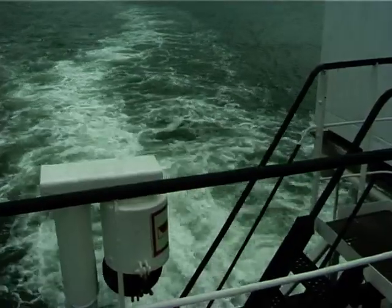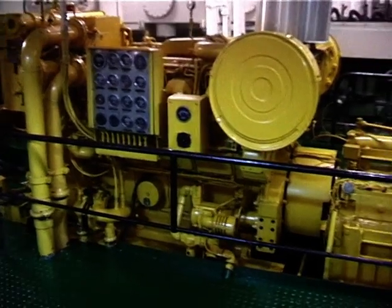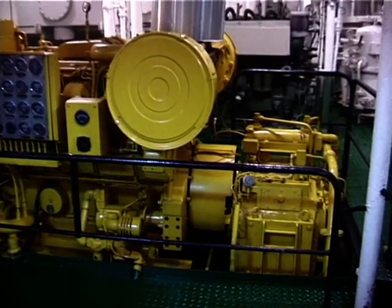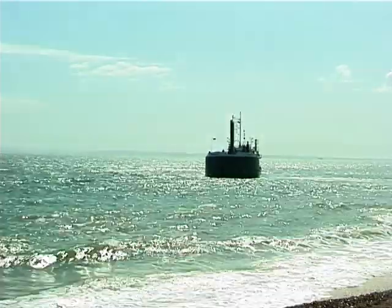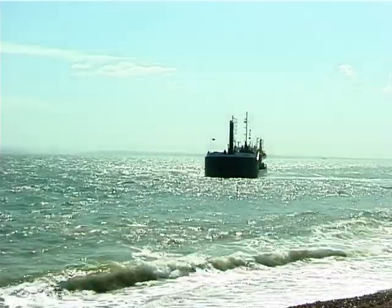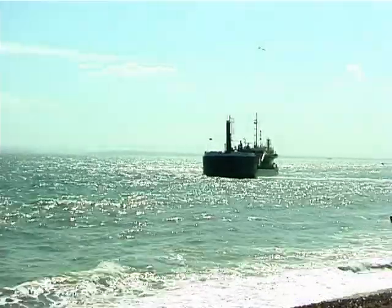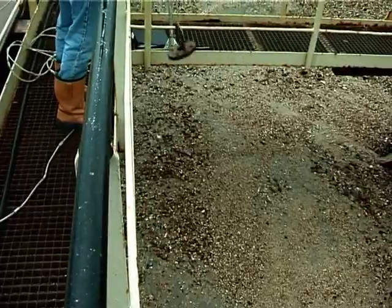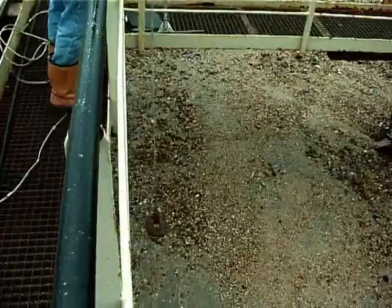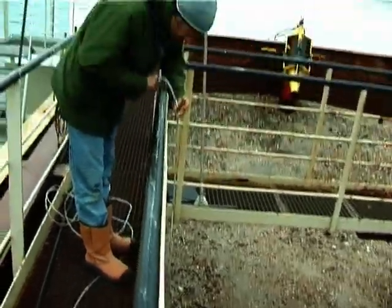Two 1250 kilowatt main engines drive the ship on the voyage between the dredge area and the location where the shingle is to be delivered. If necessary, a 283 kilowatt reversible bow thruster is used to assist in turning the ship in confined spaces. During the voyage, the hoppers are dipped in order that the volume of shingle contained may be calculated.